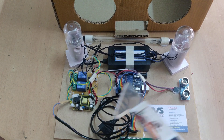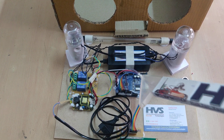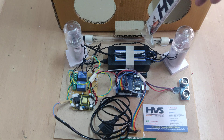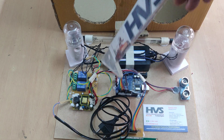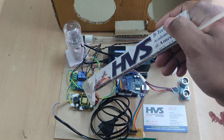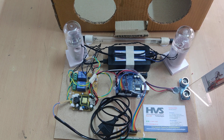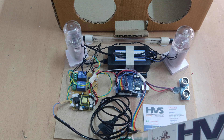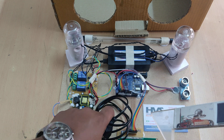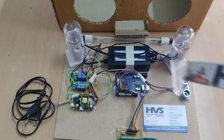The remaining connections and modules are the same. In this model we also added the feature of placing the total box inside a chamber. The UV light is interfaced directly to the device inputs via an electromagnetic relay, and one more electromagnetic relay controls the two fog mist makers. An ultrasonic sensor detects the hand, an LCD displays the timer, and a regulated power supply board takes 230 volts input and provides 5 volts constant power to all system modules.